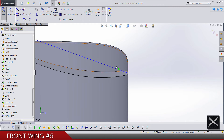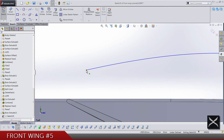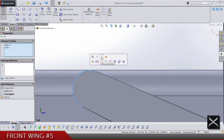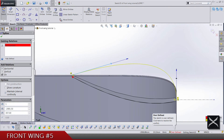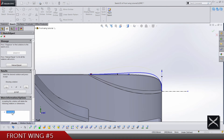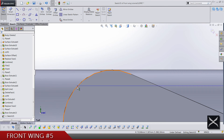We got this line fixed. Now we can add a relation between these two points — merge points. This handle is going to be vertical. For this point we need to make it tangent with this circular edge, coincident, and also coincident with this edge here. The left handle is of course horizontal. The sketch says it's over-defined — coincident — it wants to delete the relation we added. We have to make this point fixed, so find this top point and make it coincident with this point.